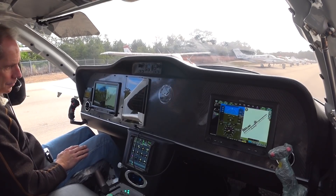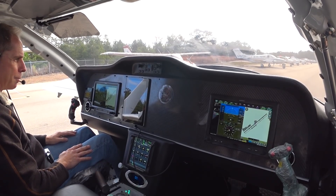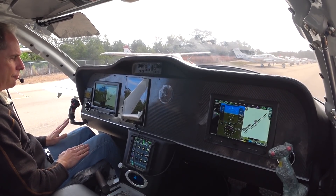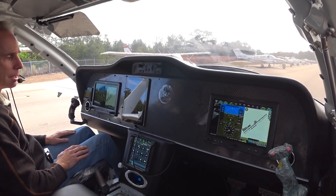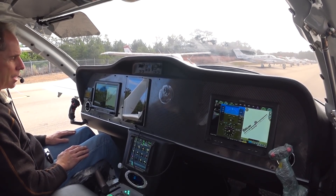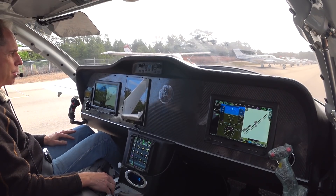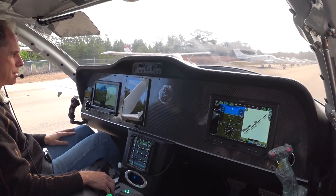Temps are at 132. I've got the governor in here the same as the other day, so the governor will come in and probably hold about 3400 RPM. I've got four of my glow plugs hooked up now and it didn't actually take too much effort to get it started with the new battery. I still need to dial in the timing on the glow plugs and obviously it'll be better when I've got all six of them firing up. I've also got this one sensor that's playing up on the air box air intake right where the filter is. I switched to a different sensor and it's still doing the same thing, so I think I might have a bad connection or bad ground just for that one sensor.